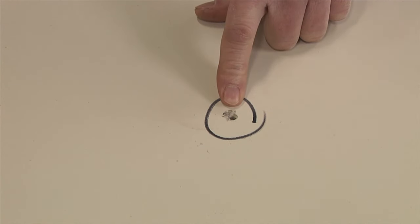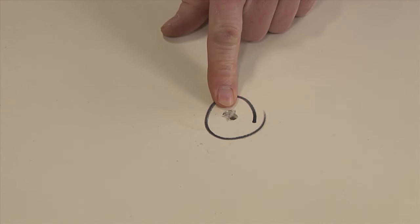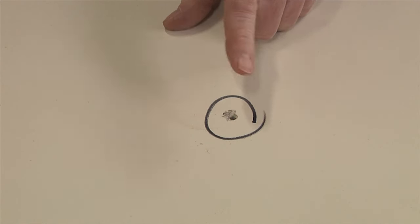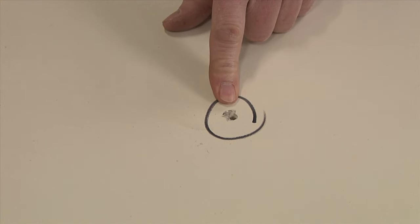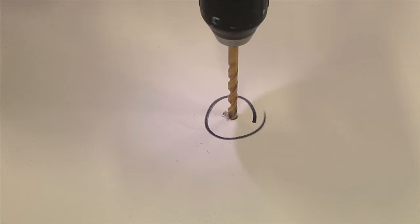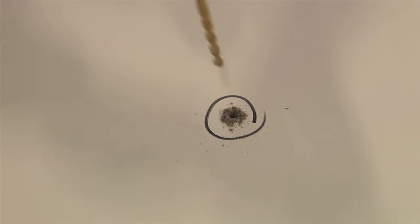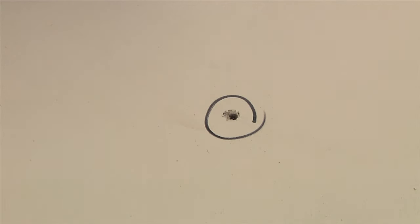We're going to start off by looking at what I consider small holes, and by that I mean they're essentially old screw holes. And size-wise, I consider anything 1/4 inch or less to be a small hole. These are probably the most common and actually the easiest to deal with. The way that we're going to deal with these is we're going to first come in and drill out the hole. By drilling this out, we're going to allow the epoxy to bite onto fresh fiberglass up on the surface, as well as some fresh balsa inside the coring.